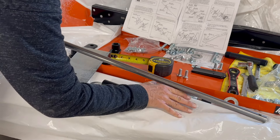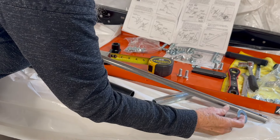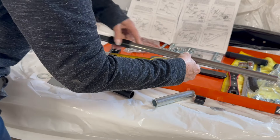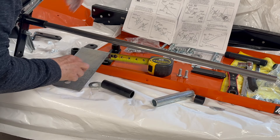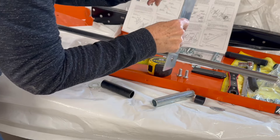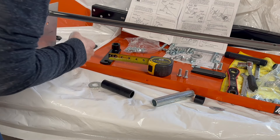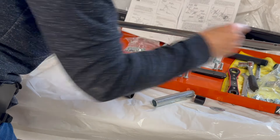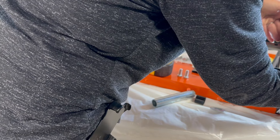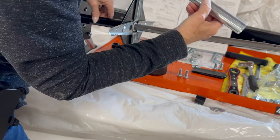After that comes the big tine unit, and then the long shaft — which is this — a long spacer that's five-and-some-odd inches, then another tine, a one-inch spacer, and your other washer. Let's put all that together. Here we are on the long end of the shaft. There we go: spacer, now the O-ring, and now this piece here — it has that shape pointing to the middle. Then you need another O-ring and the 3.9-inch spacer, which is kind of the most important part of this whole project. Don't forget to keep those plastic rings on there.